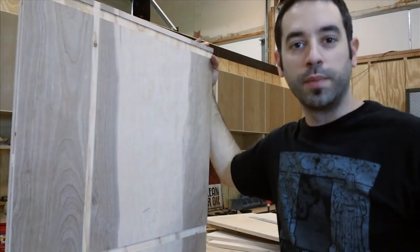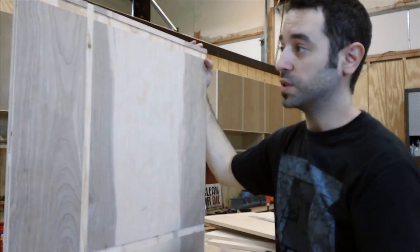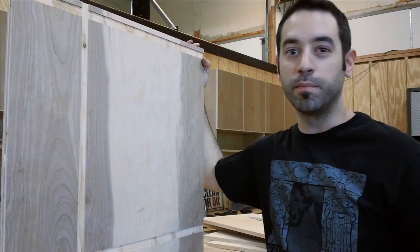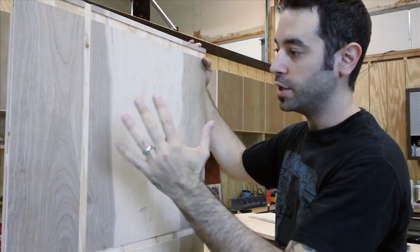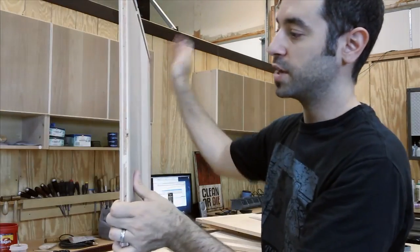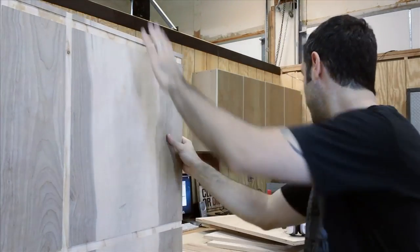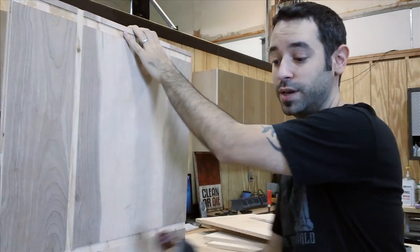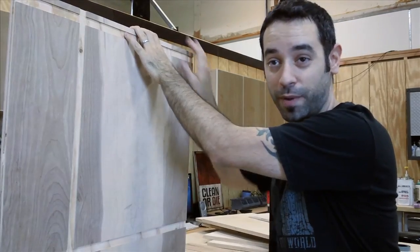Now the reason we worry about this at all is because if you don't do this, you may have an uneven depth as you go across the length of a board. So let's say this is a bookcase side or a cabinet side — once you put this other piece in here and you clamp everything together, you may wind up on the outside of your case with a bow as soon as you put clamping pressure on there, because it's not an even depth. So honestly, to avoid frustration and to make sure your projects come out nice and clean, it's probably not a bad idea to invest in a router plane. It's a great tool — next to my block plane, one of my most used hand tools in the shop. I highly recommend you get one.